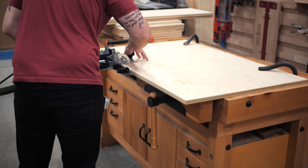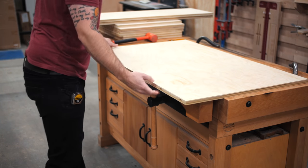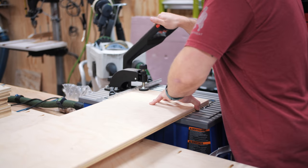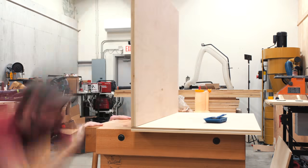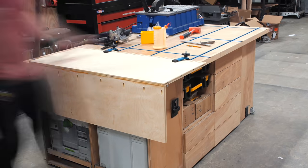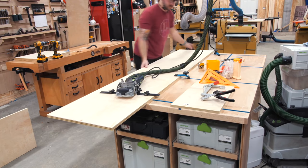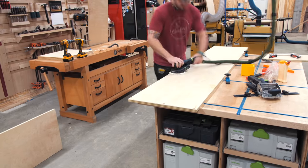With the closet cabinet parts ready for finish prep, I moved back to assembling the Murphy bed cabinets — though in reality I was working on them simultaneously. I did a video on building a queen-size Murphy bed cabinet about a year ago and the process here was essentially the same. I attached the top and bottom panels to the upper and lower headboard panels using dominoes, pocket holes, and glue, then cut domino mortises into the sides of these assemblies and the side panels. You could also use dowels, but I wouldn't rely on just pocket screws here as the cabinet needs to be very strong to handle the forces of the Murphy bed hardware — Rockler is very particular about this in their instructions.